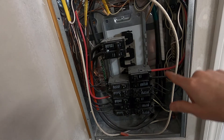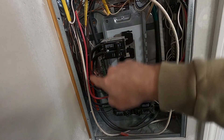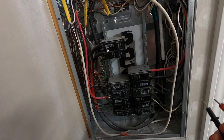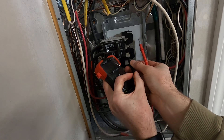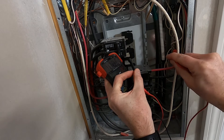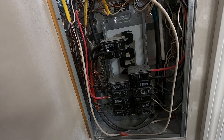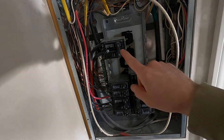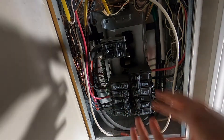When we're looking in the breaker panel, we've got all our power wires. Within the center here, this is going to be hot as well. You've got bars on each side — these are your ground or neutral, depending on your setup and how new your box is. To check if the whole box is hot: when we kill the main, it should kill the entire box. If we're not sure, take our meter — I can touch it to one of those and then come over to my ground and I can see 120. So that tells me that's hot; this box is still hot. We haven't killed the power to it. We need to go back and do that. Now I've got a separate battery powered light over here so when I kill this breaker it's going to kill all my lights in here. So we've got power killed to this whole breaker box now.